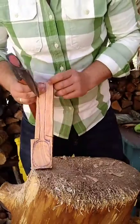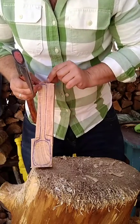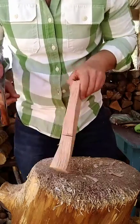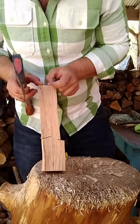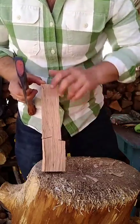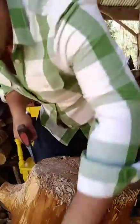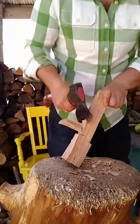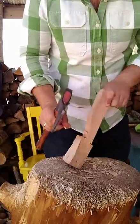So one thing I'm looking at here is the grain on this piece kind of dips into the handle. And I bet that if I were to go split it here, it would dip in and actually split out the handle the way I want. So you do have to be paying attention to where the grain goes. Now, the grain back here, see this line of grain goes right down here, right down the center. So in this instance, I would actually use that popping the wood free technique for the entire length of the handle, which is more work, but in a situation like that, where I'm pretty sure it wouldn't do a split